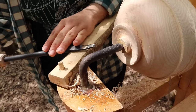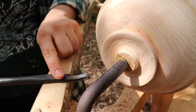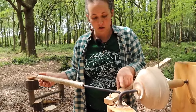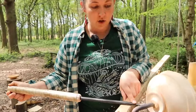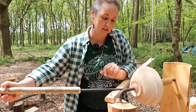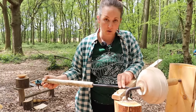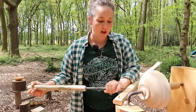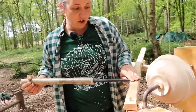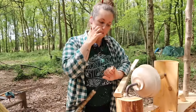Something that I didn't mention earlier is, as you're starting turning at all, it's a really great tool to think of there being an anchor point here as you have your tool on the tool rest. And as you turn, you make a pivot until you're no longer cutting, slicing, the tool is no longer engaged with the material, and then you reposition your tool and keep going. If as you do that, you stay in a very singular plane here, you'll end up with a bowl with little convex shapes in it.